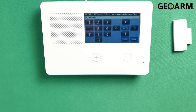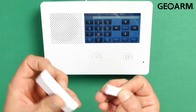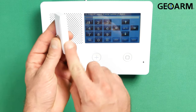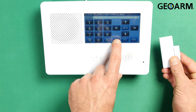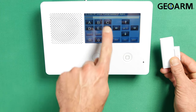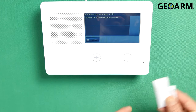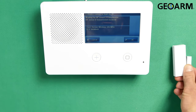It's gonna ask you if you want this device to act as a normally open device. I do not. Press the down arrow. Now this is where we're gonna learn it in. It wants you to either manually enter the serial number or learn it in. I suggest learning it in just because then you know the system has acknowledged it and is accepting it. So I'm gonna grab my contact here — I have it on the side with the three perforations, that's where the magnet goes. And what we're gonna do is hit Shift on the touch screen itself. Once you hit Shift, you'll see a bunch of new menus pop up. We're gonna hit Learn. Once we hit Learn, we're just gonna remove the contact from the magnet, put it back, and then it should automatically learn in.